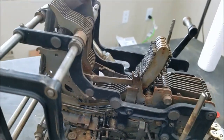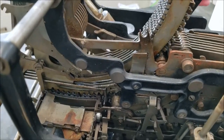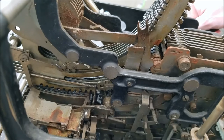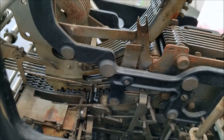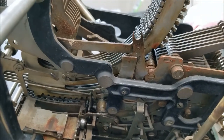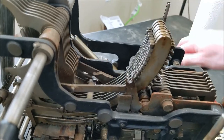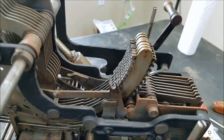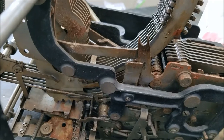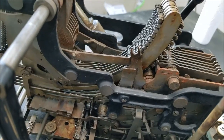Let me show you that — I'll fill this up with all fives. Watch: it should drop the register to disengage it, then rise up, then engage the register. You can see it dropped the register, all the risers are rising up until stopped by the pins, the hammer is fired, now it's going to engage the register and drive it forward five positions. If I do a total — watch, it'll leave the register engaged and turn back until that stop hits, and these have raised up five positions. That's basically how that works.